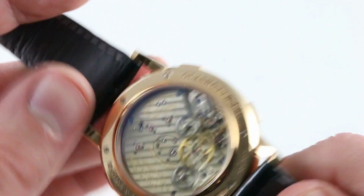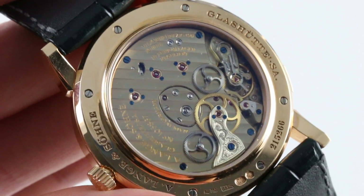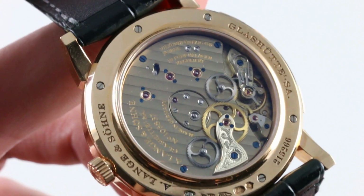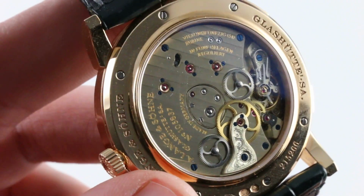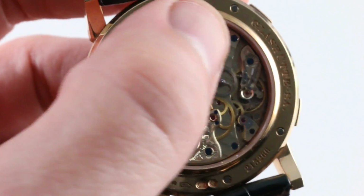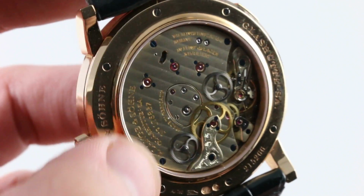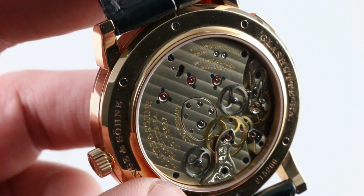Now, turning the watch over, you can see it is richly appointed, and this is where, with no additional need to place the watch on the wrist for a wide shot, we can get right into the mechanism. Development started in 2003, it came to market in 2005, and thus this movement, per Lange's convention, is the L031.1. So you'll note beautifully executed but double engraved, as you can see, the mechanism for the travel time as well as the conventional balance cock both freehand engraved in an elaborate, almost Art Nouveau style. 3-day power reserve, twin mainspring barrels, hacking seconds, dual time functionality, of course that unique geographic display system.